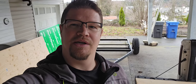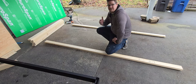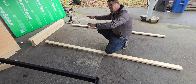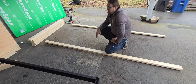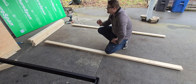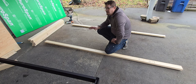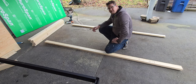If you're following along at home and you want to do something like this yourself, this is a very basic setup. I've seen a few different videos where they've done this — you get a 2x4 frame laid flat, frame it all out, get it all screwed together, put a layer of plywood down, glue it with PL glue or some sort of construction adhesive, get it all glued, screwed, and stapled. Then flip the whole thing over, put some styrofoam insulation in between all the gaps, and do another layer of plywood over top so you have a nice thick solid floor.